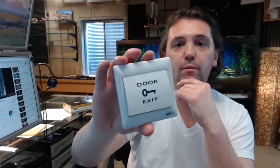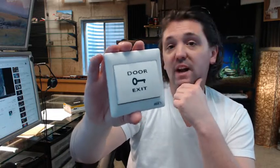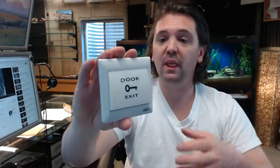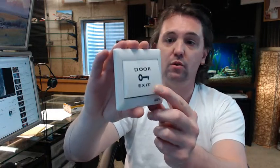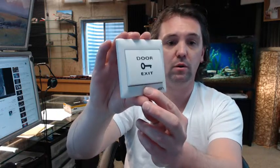This is a switch used to temporarily control some electrical device on a door. Think of maybe an electromagnetic lock where you have a reception person sitting inside a vestibule and you want to be able to interrupt the power to the lock. You can do so by just hitting that momentary rocker switch, and as soon as you let it go, the circuit is back to its original state.